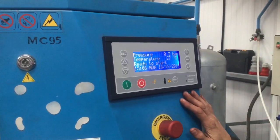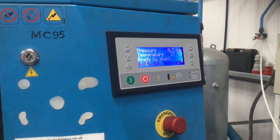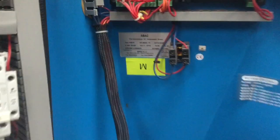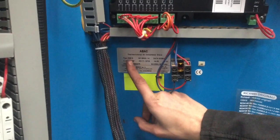Programming a new MC2 board to tell it which compressor it's running. The first thing we need to know is what compressor we actually have. On the manufacturer sticker, the type is an RS.